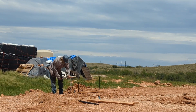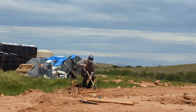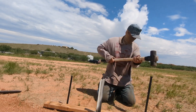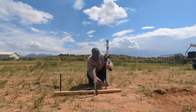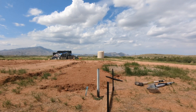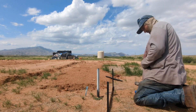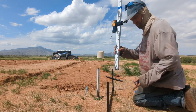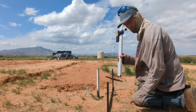This is where I set my batter board. Basically, wherever the bottom of this hits — because I set this thing down 6 inches — that means I have to go up 6 inches in order to meet the laser reference point, which means that's where the top of this thing is going to be.